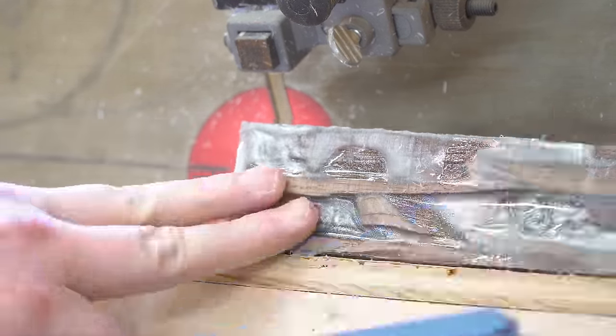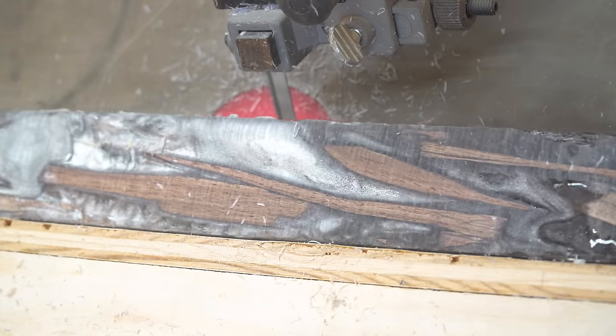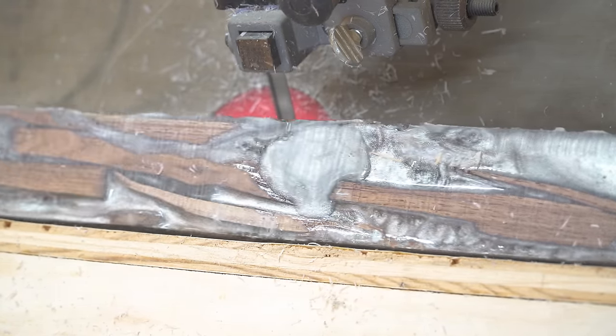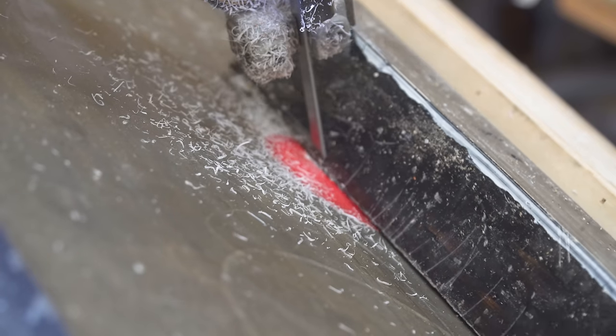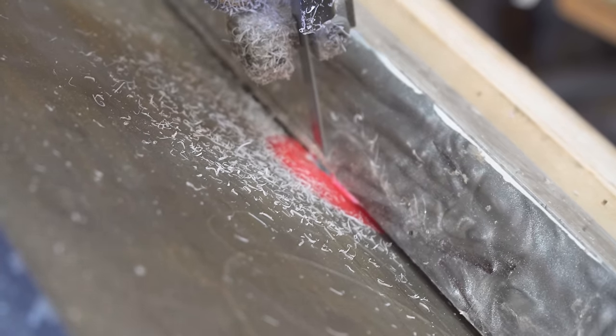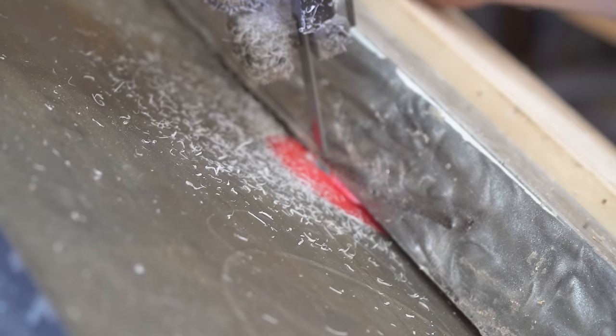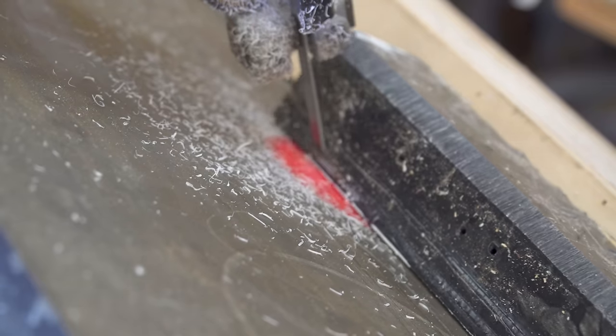You get much less tear-out and shattering, especially with the epoxy. If you're using carbide tools on these corners it will cause some shattering of the epoxy on the lathe. Removing the corners is a really easy process by just using an angle with the bed of the bandsaw and cutting off the corners. It's not very difficult at all and it's well worth the effort.